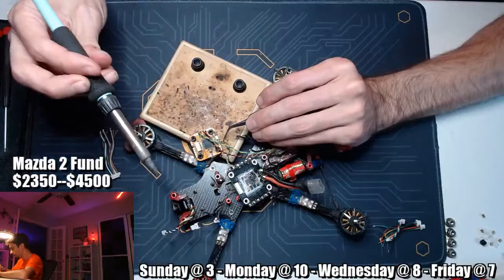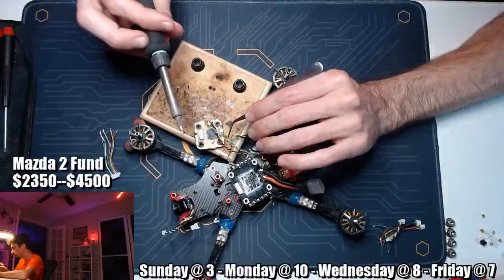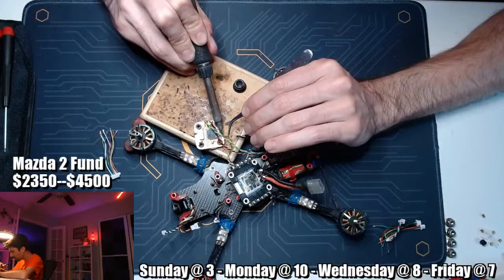Left hand is going to control the wire. Right hand is just going to bring the heat. You do not want to be trying to control the wire with the tip of the soldering iron. That is never going to work well. Your left hand is to control the wire. Your right hand is to bring heat.